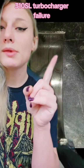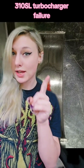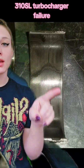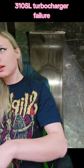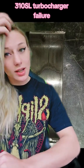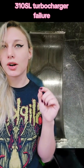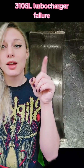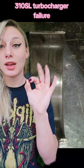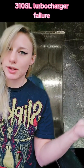As promised, this was one of the rod bearings off of that same engine. As you can see, that's quite a bit of wear — especially considering this engine was nowhere near the hours it needed to be rebuilt. So that was bad. We actually ended up getting a new engine for this backhoe. No oil pressure codes, no oil pressure light, nothing — the only thing that told anybody something was wrong was the turbocharger failing catastrophically.